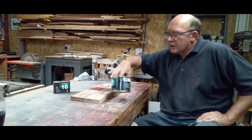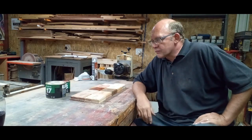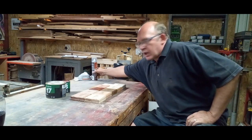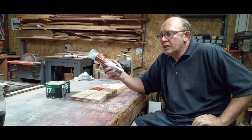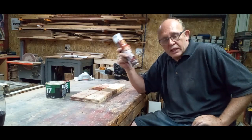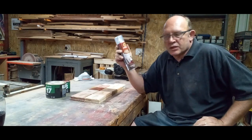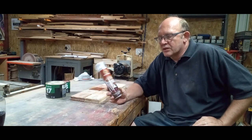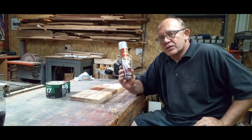Then as a finish, I used the same brand, but their polyurethane gloss to put on the office chair. Works a charm, really easy to work with, and every time a good result. Then on the easels and the little book racks, bookshelves, book boxes that we built, I also used a polyurethane, but it's an aerosol can. It works out a bit more expensive than the tins, but the reason I use this especially for small surfaces like the easels is that it's quick dry. So you put a coat of this on it, leave it for 10 or 20 minutes, put the next coat on, your third coat, you're done. Really nice. You also get these polyurethane aerosol cans in gloss, matte, and even in color, so you already have a stain in it. So very nice to use.